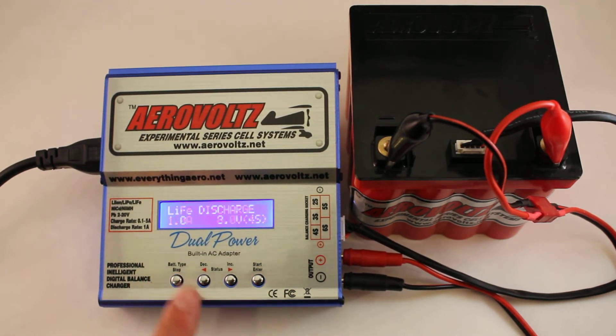To stop it, just hit the stop button and we're stopped. That's the discharge mode. Only use that if you feel your cell packs are out of synchronization — you can see that from just about any of the charge modes by hitting the increase button to toggle back and forth. But you have to have that balance cable hooked up to do that, or the battery charger will think you've got a bad connection and will stop the charge mode.